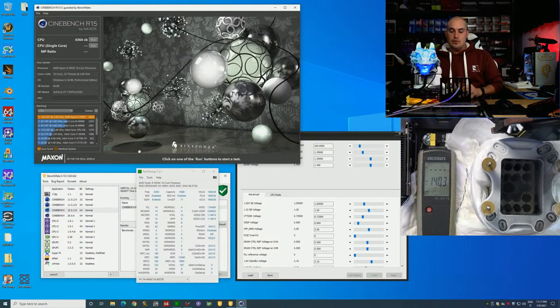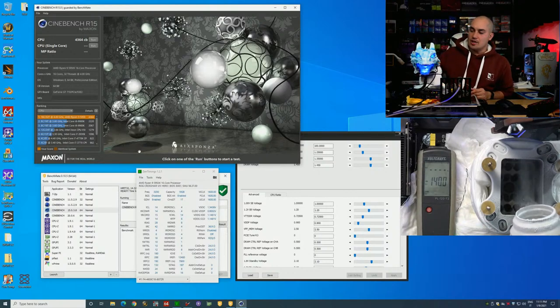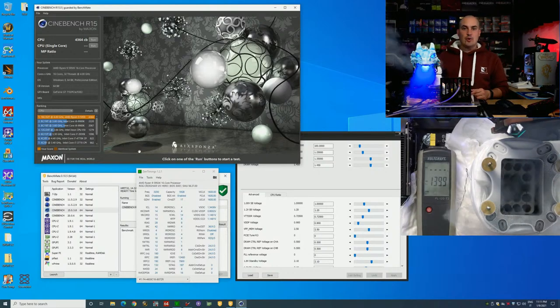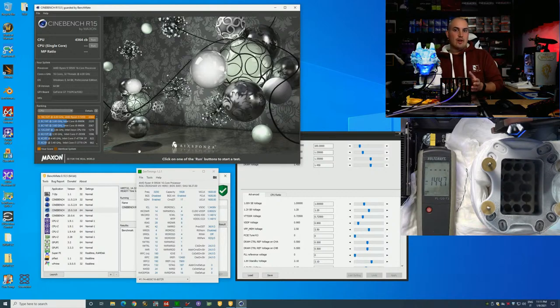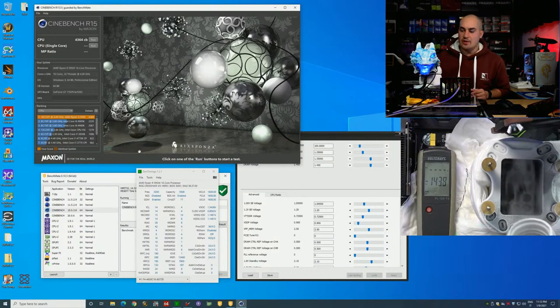I think I'm going to use a nitrogen membrane separator first to obtain more pure nitrogen out of the air, since I don't want oxygen here, because if we have a spark or something, it is dangerous. And then when I have more pure nitrogen, I will use a Stirling cryo cooler. I think it's like a helium pump resonating, and I just need negative 200, so 77 Kelvin. There's also a much bigger one, but well, let's see what I can find on eBay.